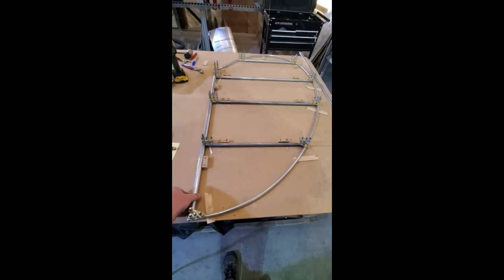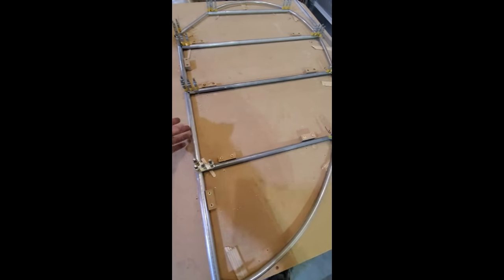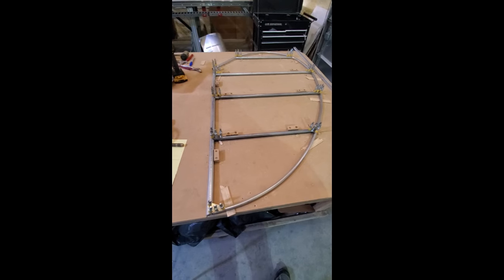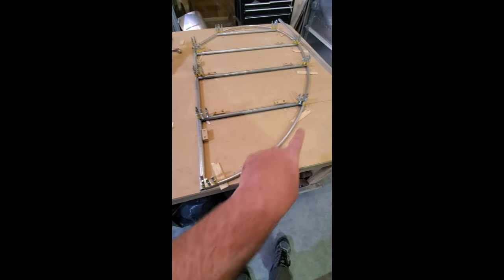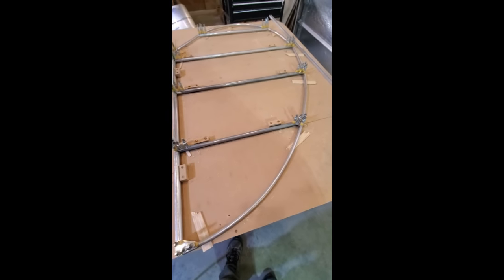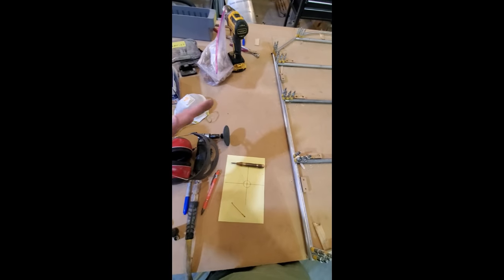Now, I took off a lot of blocks here, and this thing's just kind of free-floating now. I've got it so that I can just press the spar this way and then press the ribs up. The reason I did that is because this thing is going to flex. We don't want to assume that this is going to be the same exact shape as it was when it was clamped down to the table perfectly rigid, because it's not. There are some stresses in this trailing edge tube, and we want to see, first off, if any ribs pull away from the blocks, if they start to tilt down, which in this case they're not, because there's not too much tension on that. But also, we want this thing to have its own natural shape as we lead into the vertical fin, so we don't have a vertical fin and then a rudder. We want vertical fin, rudder, a nice, smooth transition. So we took all the pressure off of it.